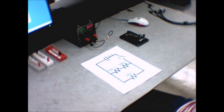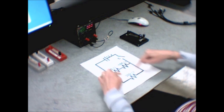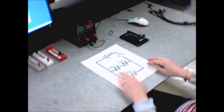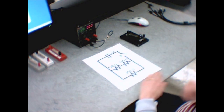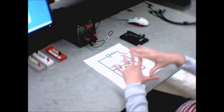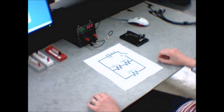Here's the third circuit, which is a combination of resistors in parallel and in series. As before, I recommend hooking up the inner loop first, and once that's fully connected, adding the second loop. Also as before, unplug everything and start from scratch — that way you're least likely to get confused.